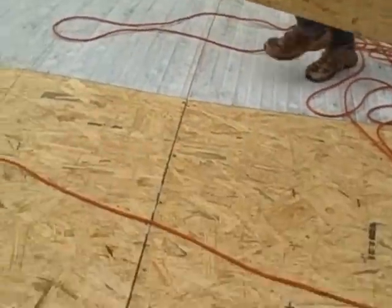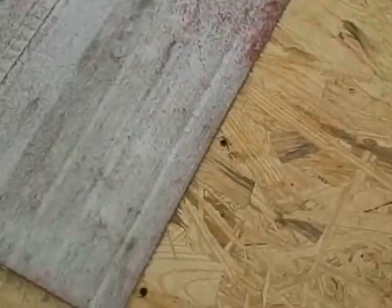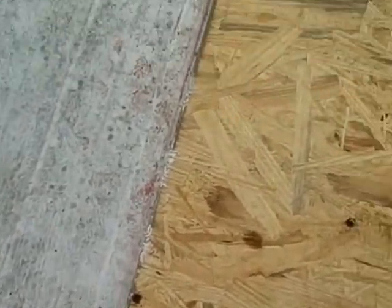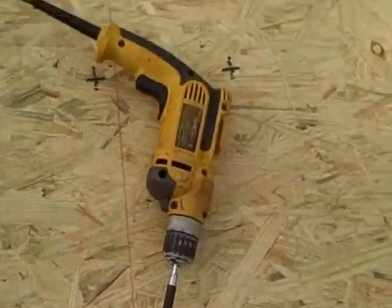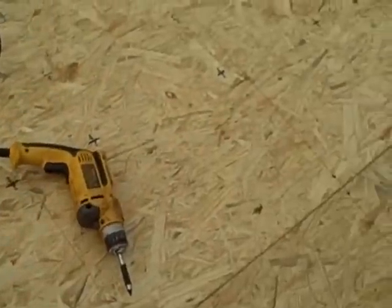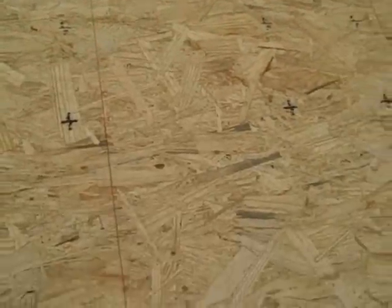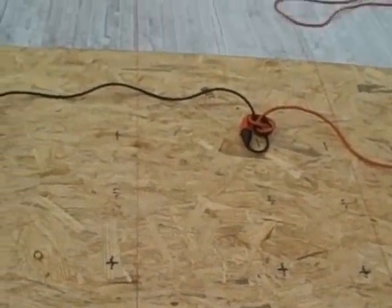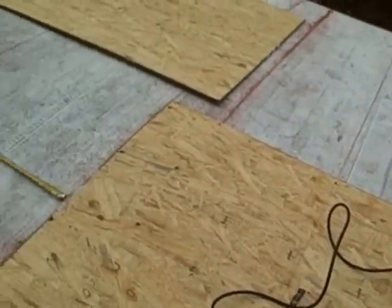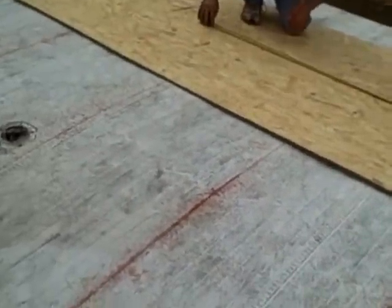Got Billy setting up plywood, me coming behind him helping him set up the sheet and screwing. He's marking for vent pipes and cutting them out. We're screwing off these ends — five screws every chalk line, five, all the way across. We bring our bottom lines to the top of the sheet as we go across, so you want to bring that across. That keeps you lined up on your roof trusses, because there are only two-by-twos under there. Important that you mark your lines to your pipes carefully — you don't want to have them off in any direction.